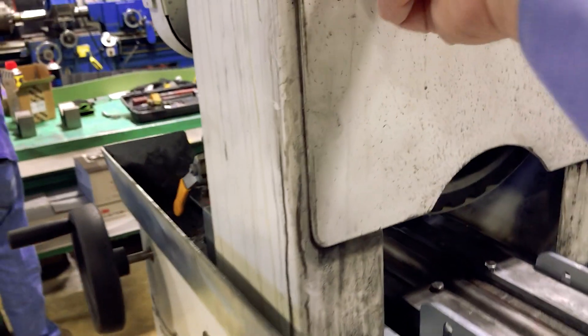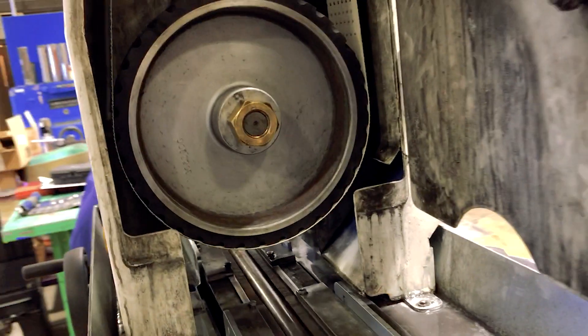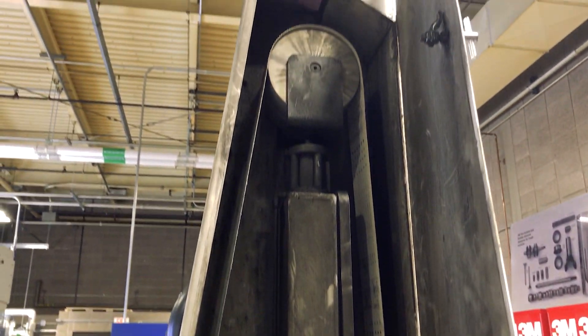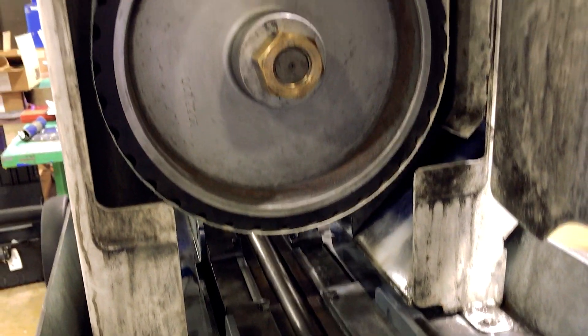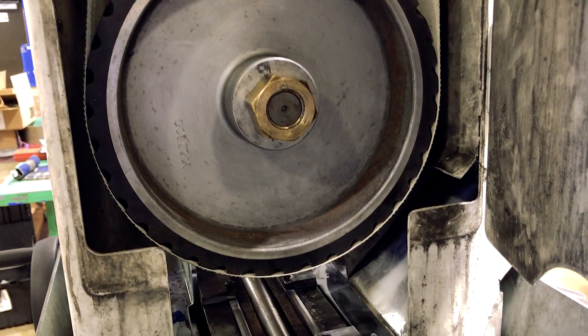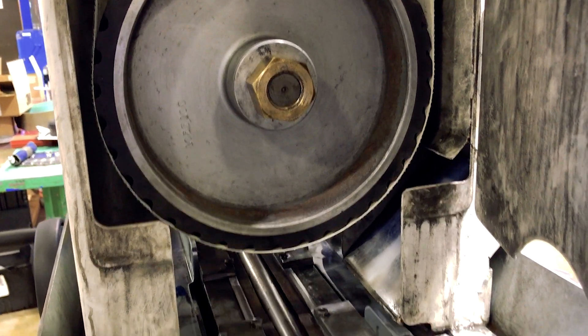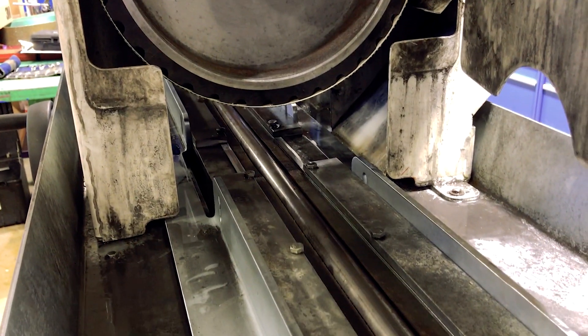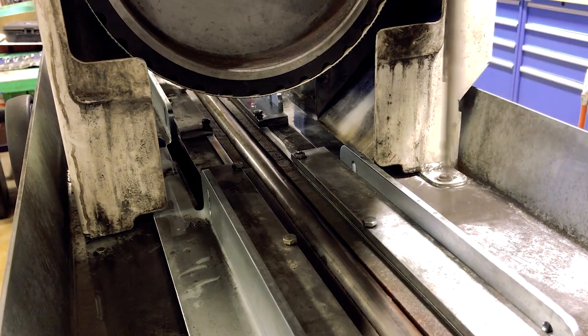Opening the door — right at the inside of the machine, we do have a pneumatic cylinder to track the abrasive belt. That's a 4x90. We've got a 35 durometer contact drum. You can take that contact drum off and put on a Scotch-Brite wheel, a wire brush, a buffing wheel, or a cotton contact drum. So it's a very versatile machine — lots of different abrasive media can be run on this RB60, as well as all of our RB machines.